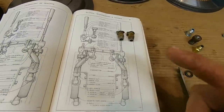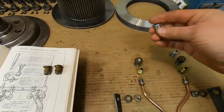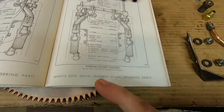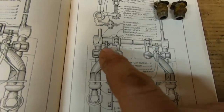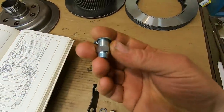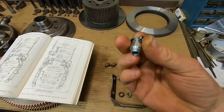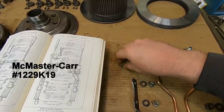I want to talk about these new little spring-cap oil cups that I sourced for $11.13, as both of the old ones were broken in the hinge area and pretty well stuck — that's common for these. This is the early first-gen design, only used up until serial 5J1178. After that they went to a much different design. These are the 4B350 oil cup. I couldn't find these available anywhere, but I got them from McMaster-Carr, and they're a pretty close facsimile of the originals — the new ones are a little bit larger. I'll throw the part number on screen so you can have it for your records.